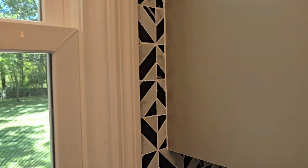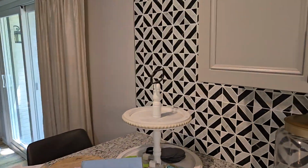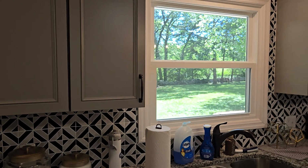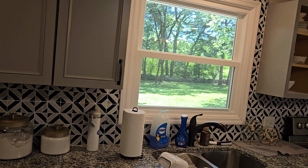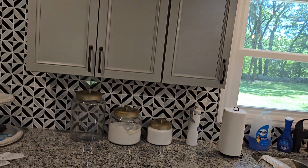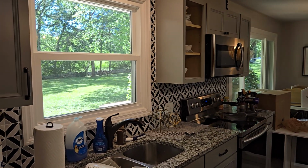However, on all of the rest of the cabinets, as you can see, we do not have that trim piece there at all. So one option is to not have any trim piece there and instead take that starter crown molding with a square edge so that we can make it flat against the edge of that trim piece and take care of that area there and make it look like it was originally built that way. That is one reason to go ahead and have that starter crown molding. So we may not need an additional scribe molding to go all the way up only on that one side, especially since we do have the Schluter on that side as well.